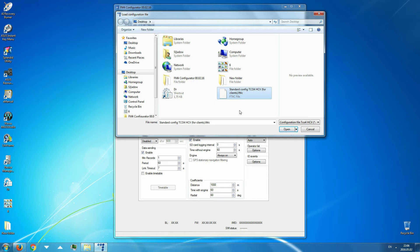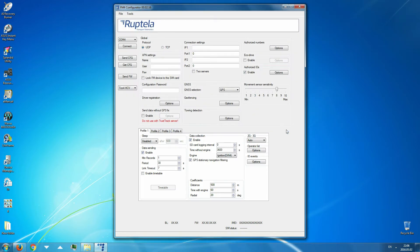Only configurations compatible with this device can be chosen. Before proceeding, you must provide additional information. First, in the Global Settings section, fill in the Connection Settings fields. Enter your service IP address and port number. Secondly, choose a protocol — UDP or TCP protocols can be chosen. Finally, enter the APN settings provided to you by your GSM GPRS provider. Note that values entered in the IP address, port number, and APN name fields in this video are used only as an example.